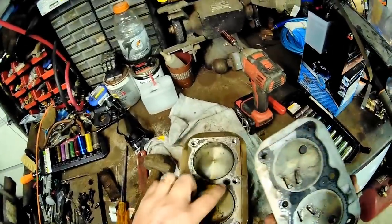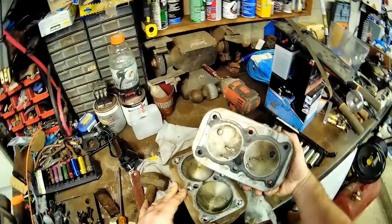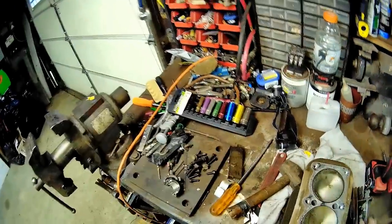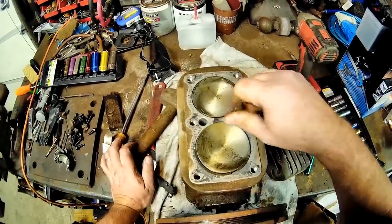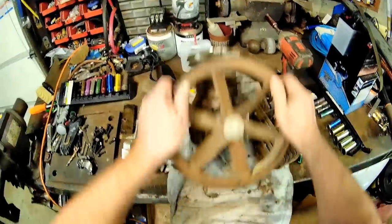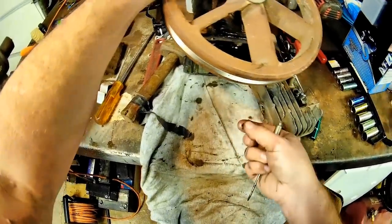The reed plate stayed. I guess this does have venting — the crank vents up through one of these holes. The crank is venting through a hole, and I don't even see it going all the way through. Is it plugged? Oh, there it is — but it is plugged. You see how I can see through that one hole? This one's blocked off. There must be something in there — it was actually part of the filter, stuck down in there. I wonder how well that was venting. That could have been the problem why the seals ended up blowing out.